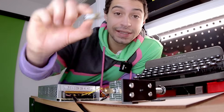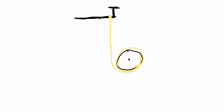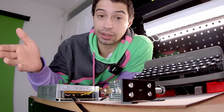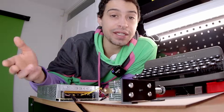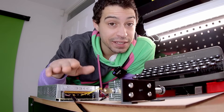The second contender was this guy right here. These guys are small, have a lot of torque and can still be quite fast. To pull the string, my initial thought was using a wheel that would wind up the string. That would pull the key really quickly. While that sounds like it might work, it's got a few issues. First, I got no indication when to stop pulling, which might make me break the string or even worse, damage the typewriter. On top of that, the gears of the motor would not allow the key to reset automatically, which means I would actively have to unwind the motor — that's too much work. I skipped that approach completely.